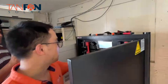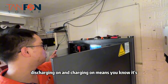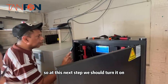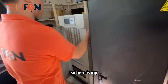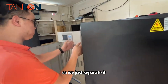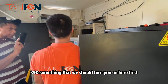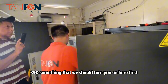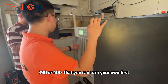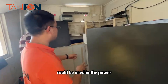When the battery is on and charging is on, it's showing 99%. The next step is to check the discharging and charging parts separately. If the home bus voltage is around 390 or above, we should turn on the discharging side first. Around 390 to 400 volts, you can turn it on and it can begin using power.